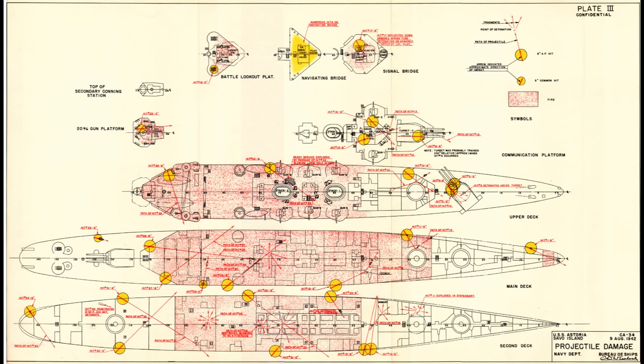The last consideration before the ship reaches any port is whether the damage control efforts undertaken to mitigate the initial situation have themselves caused further damage. You might have welded doors or hatches shut to stop the spread of water. You might have ended up with compartments flooded by water percolating down from firefighting efforts that were not originally affected by the initial damage. Likewise, water damage to components, chemical damage to components, or areas where fires were allowed to spread in preference to them spreading elsewhere.